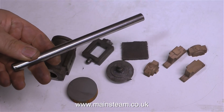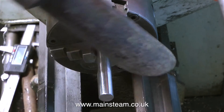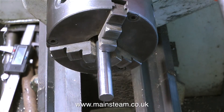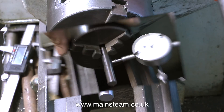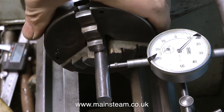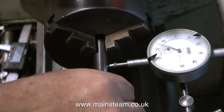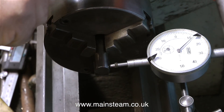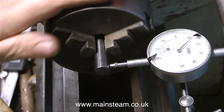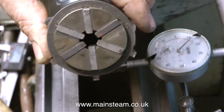Here is the aforementioned piece of mild steel that comes with the kit of castings. What I'm doing at the moment is vacuuming up my lathe — this is something that I seldom do, but in this case I need it very clean, because I'm going to fit a dial test indicator which has a magnetic base, which sticks to the cast iron bed and holds the dial test indicator firmly in place. This dial test indicator is an essential tool for the workshop, and it allows me to check that my lathe chuck is true. You can put a piece of bar in your three-jaw chuck that you think is accurate, and then use the DTI, or dial test indicator, to check the accuracy of rotation.